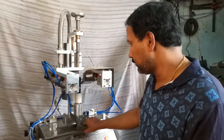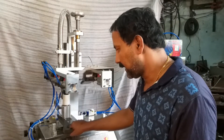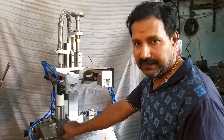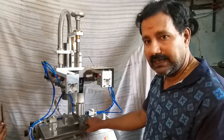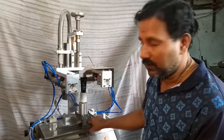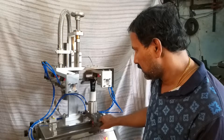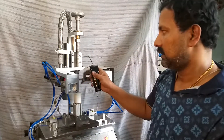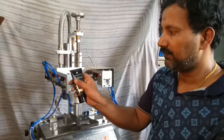Now I am showing you how to seal. First I am moving the tube holder to the left side. Now the tube is heated, then the sealing is done — you can see the sealing is done. Now to get a finished look, I am moving the tube holder to the right side. Once it is cut, the tube is finished. A perfect sealing finish is maintained from this machine.